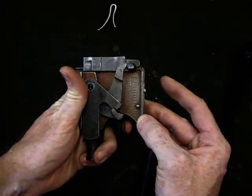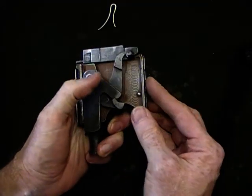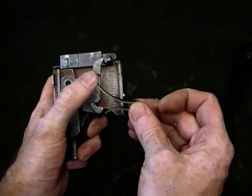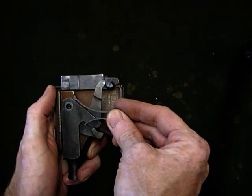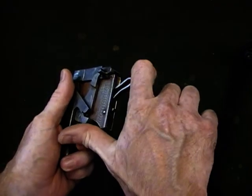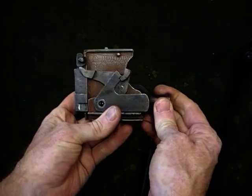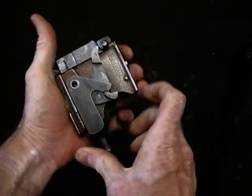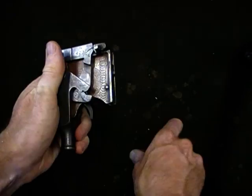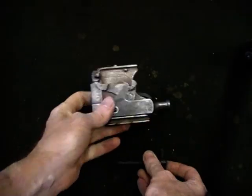It won't go there at the moment, so we're going to pull back the trigger, push down the tumbler, hold down the side levers so the sear engages — that's now fired. The reason being is we need to make sure that the long edge of the lock spring engages with the front of the firing pin. To do that, we need to push the long edge in first, push this in under a considerable amount of pressure, and it will all fall into place. So there we've got the reassembled lock in the fired position. We can just test it by lifting the side levers, pushing that up — it will all sit into place — and we're going to use the long edge of the T-piece to fire it. And there we go.